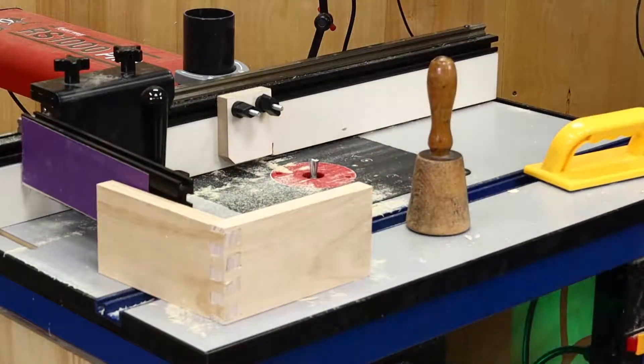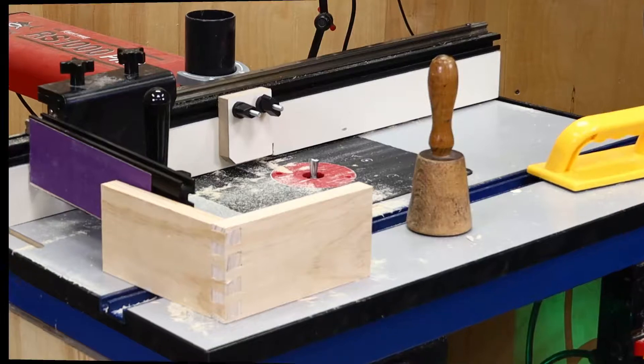A few things to consider when cutting through dovetails with the RS1000 Pro: make sure the ends of your boards are cut perfectly square. The same goes for your router fence and sliding miter — they must be set up perfectly square with the table and with each other. Try to be as consistent as possible when cutting the parts, since even a small variation in any of these steps will negatively affect how the joint fits. But with a bit of practice, making through dovetail joints with the RS1000 Pro is fairly easy, especially if you don't have a standalone jig or don't wish to make them by hand. For links to other RS1000 Pro joinery apps, see the description below this video. Thank you.